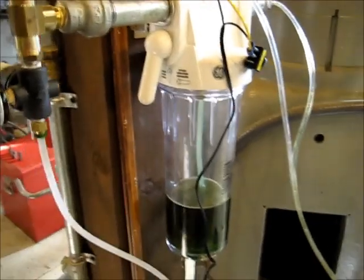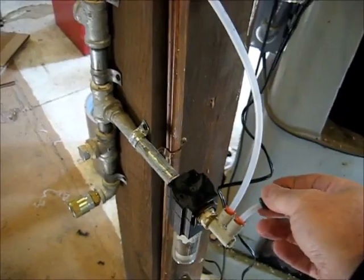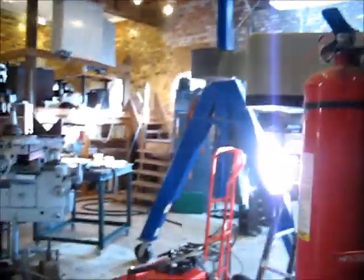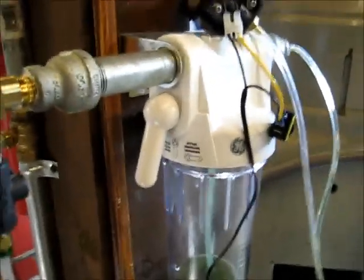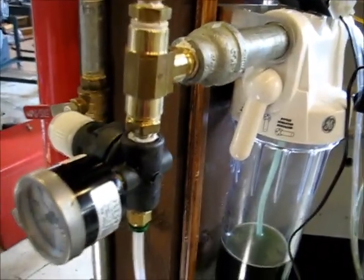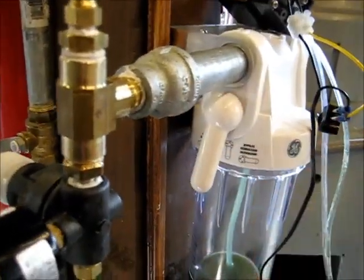We're still at the same canister here. You'll notice I have one of these airlines blocked off, coming up to my regulator. I got rid of the separate air regulator — I found that it was not necessary. As long as you pressurize the coolant to the same pressure that you pressurize the air, you seem to get all the fogless benefits. So I have one regulator now pressurizing both systems.